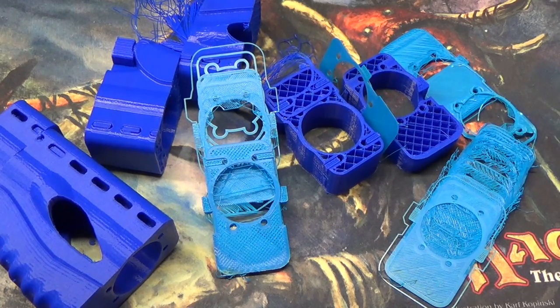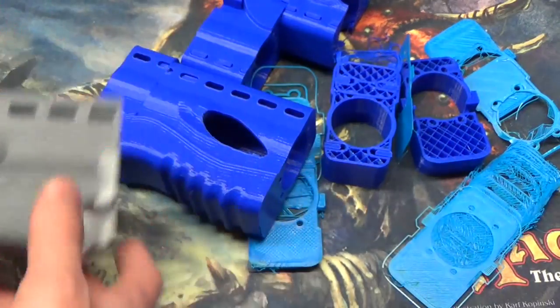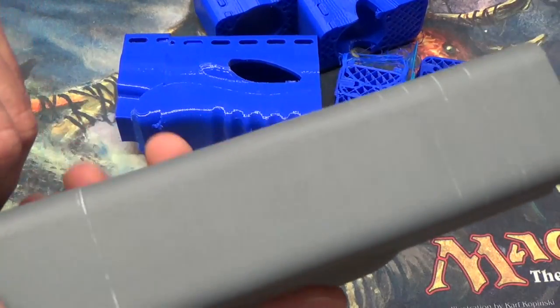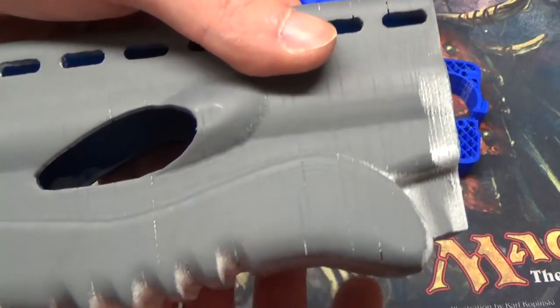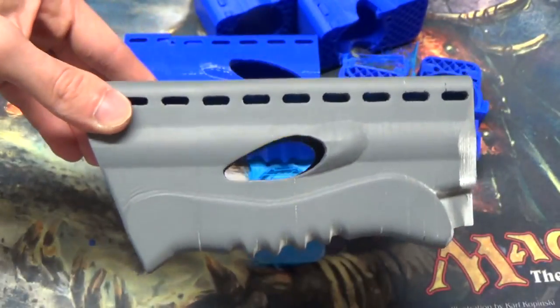I had a loose Y-axis belt that had become misaligned. Basically the printer would move slightly easier backwards than forwards, and over time that would mess up the orientation of the axes — giving me nine failed attempts. This is one I've been testing body preparation on, and here we have our successful print. Unfortunately I started printing in a lower quality plastic because I was getting upset wasting all the good plastic. Through a bunch of sanding and different coatings, I was able to remove most of the cracking that comes with this low quality plastic, though there's still a bit left to fill before finishing the blaster.